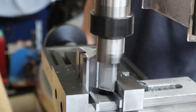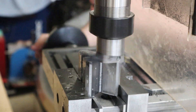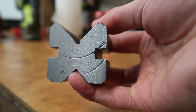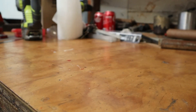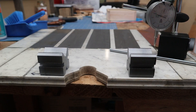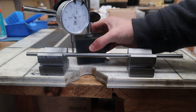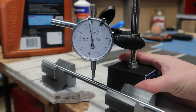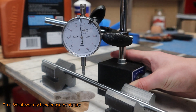The smaller one went in first and I fly cut it until it was nice and flat. I then zeroed out the Z axis DRO, changed the part over, and fly cut that down until the DRO read zero again. I hit a little snag and the part got marked up, but that's alright. To test how well I machined these parts I can use a scientific method of placing the parts on a super flat stone, putting a ground rod between them, and running my dial indicator across them. It's definitely not 100% accurate but it's the best I can do — the difference is about half a millimeter over about 150mm, which really isn't that bad at all considering it is my first part.